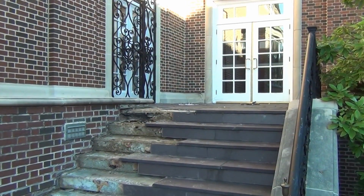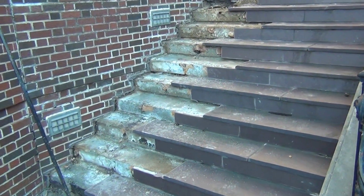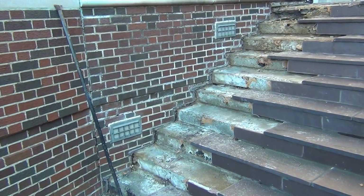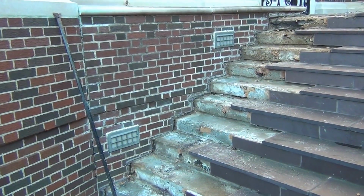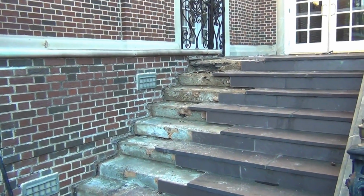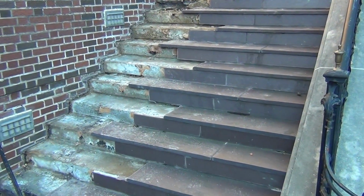Yeah. I feel fairly comfortable it's not, though, because on a suspended slab pour, they get it down to what it needs to be. They don't want it to be heavier. If it was 16 inches, that'd be so heavy that they would have to support it much more. So no, I think it's probably a 95% chance that it's a 6-8 inch slab.